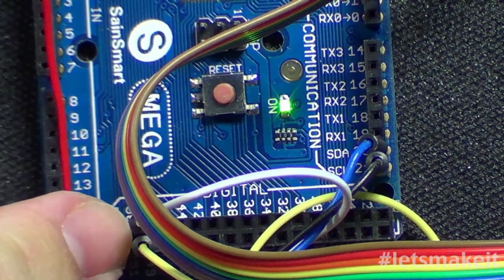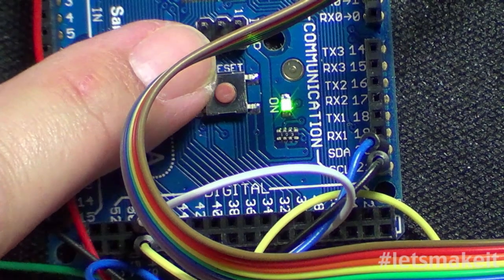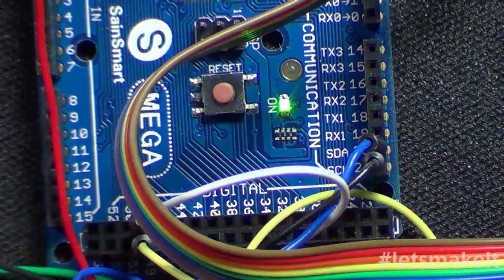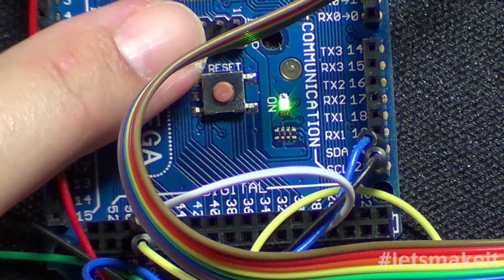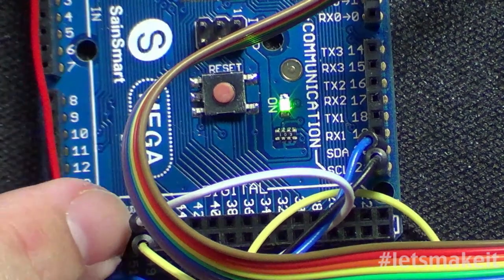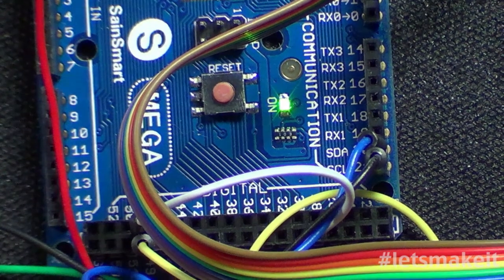It just makes it a little bit easier for us that way, we don't affect what they're using there as well. So in our code, in our library, you can see that we're doing the SDI on these 2 pins right here. If you don't specify these 2 pins, it will use these. But like I said, this is being used for both Ethernet and also for the SD card. So we decided to do our own and move it down to these 2 pins down here. But it's a very simple interface.